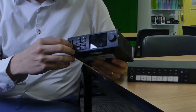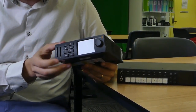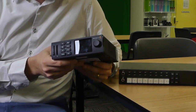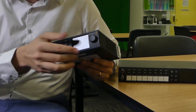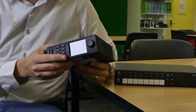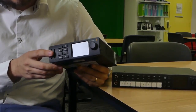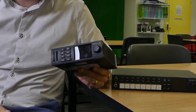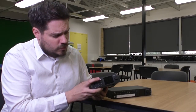You'll notice we've got an SD card in here at the moment — it's got two SD card slots that allow you to record any of the action going on. For a very simple TV studio setup, all you need to do is make sure you've got a formatted SD card in there. You can format it using the menu, set button, and the dial to exFAT — the universal file format most of you will know from ATAR film submissions. Once it's formatted, it's a simple case of pressing record when you're ready, and pressing stop when done.